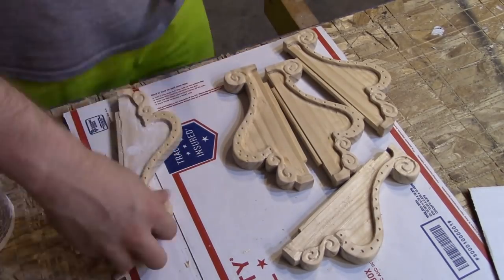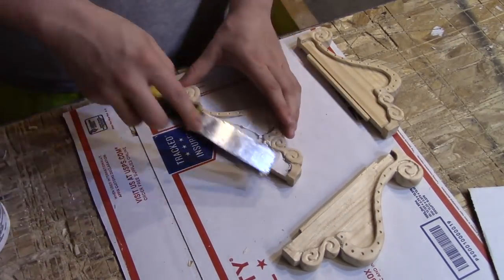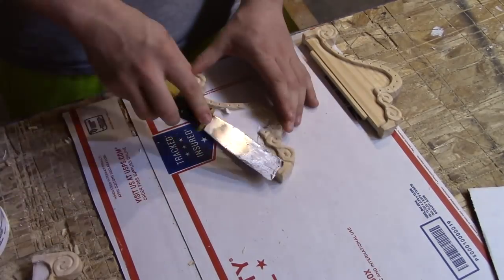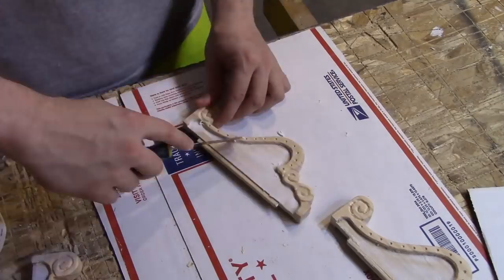After I finished sculpting the perimeter of the flanges, I noticed that the recesses had been left really rough by the machining process, which was definitely not optimal. So I went with a chisel and carved out any high spots, and then there were a bunch of little gouges and low spots left, so I went in with some spackling and filled all of those in to give me a nicer, flatter surface for painting later on.